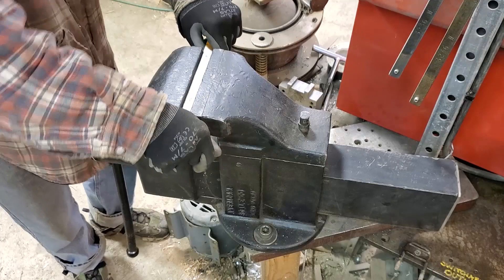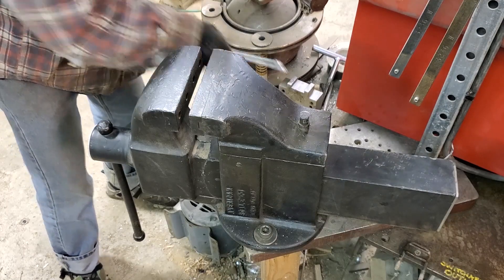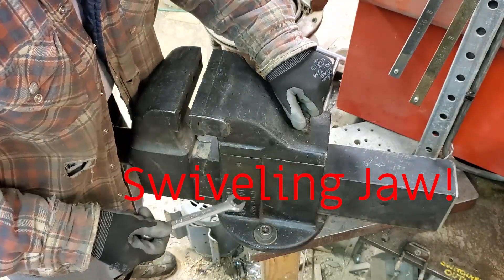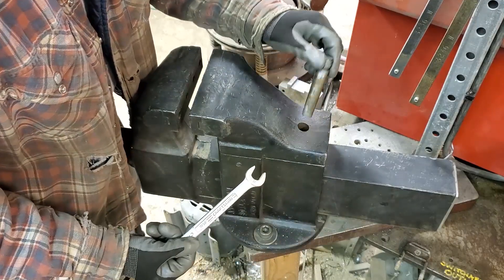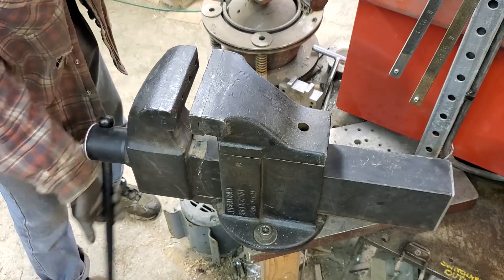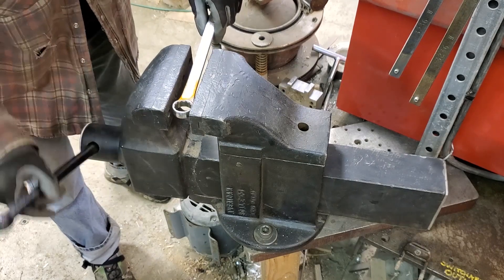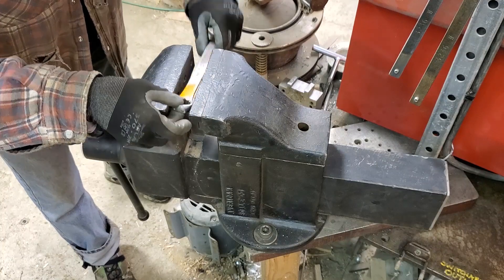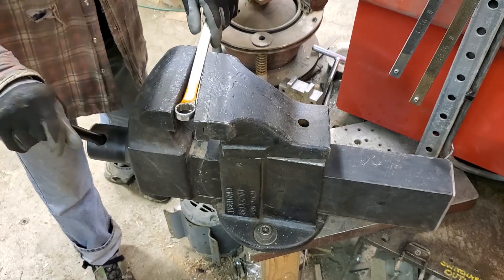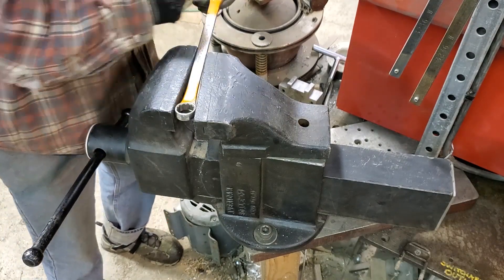What's super cool is that this has a pivoting rear jaw, or swiveling jaw. I took this little taper pin and ground flats on it so you can turn it to break it loose and remove it. When you go to clamp — check this out — normally it would stop and just pivot, but with the swiveling jaw, it's hitting at one, two, three, four points. It's solid.